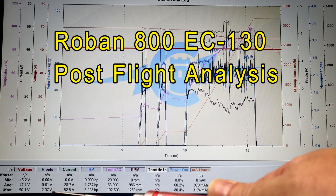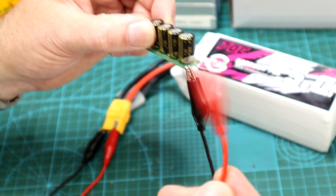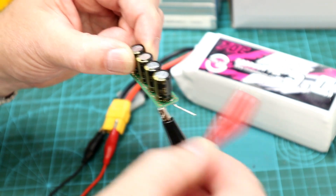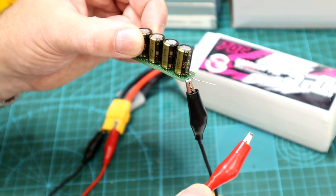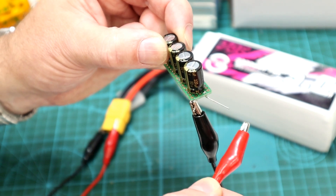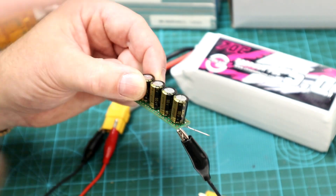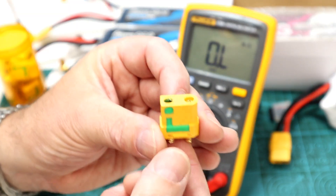Ripple voltage stayed below two and a half volts — that's my threshold on a 12S pack. So I've just got a cap pack here. This is the same thing as plugging in the ESC — we're going to be powering up these capacitors, and for a momentary time the battery or the circuit will see this as a short. We should get a fairly decent spark here. And that's what that snap and spark is from — charging those capacitors up every time you plug in your battery.